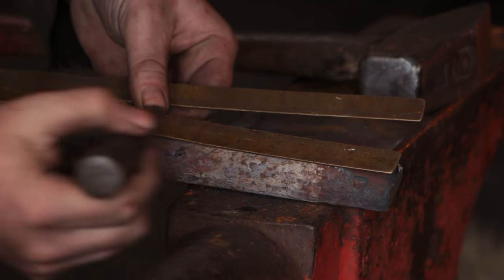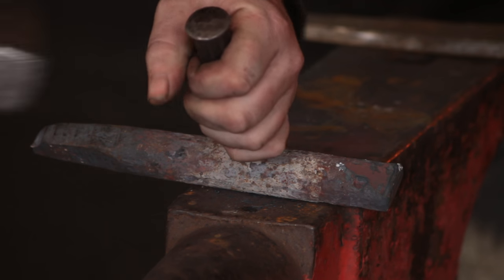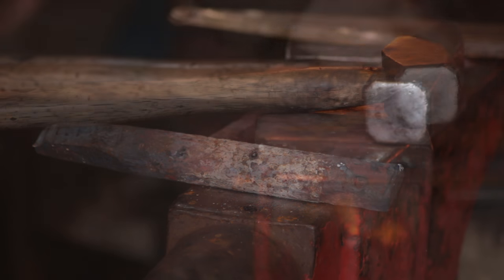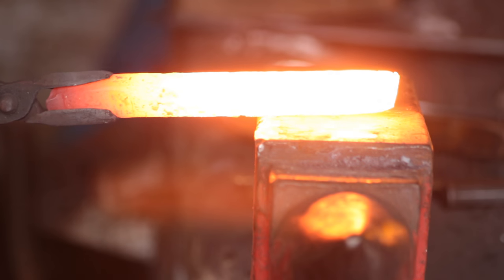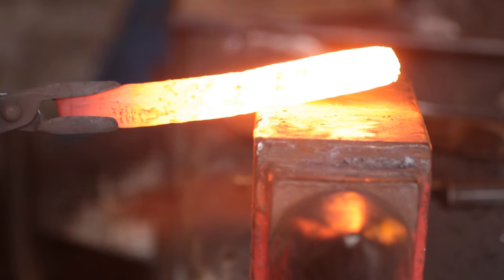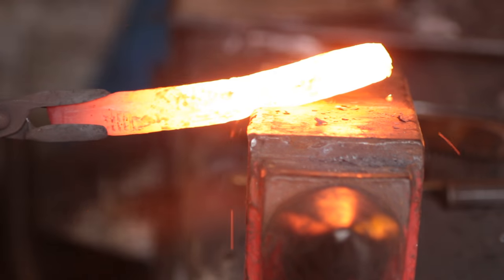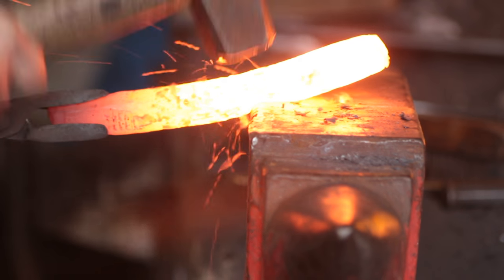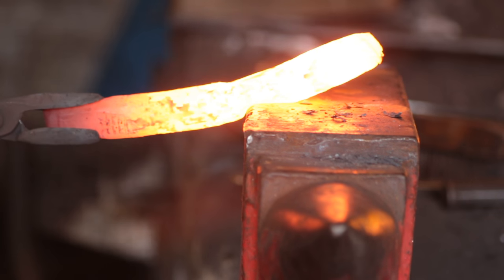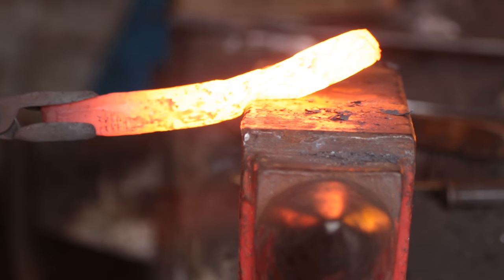I'm making this out of 30 mil round wrought iron and I center-dot it at three and a half inches from the end, fully expecting it to stretch out to five and a half inches, so I will do the set-down on the center dot. The reason we add twice the thickness of the material is that if we don't, the outside of the eye will be five inches long, meaning the eye itself will be thinner than needed. Adding twice the thickness means the inside measurement of the eye is five inches.